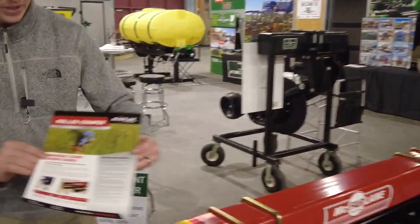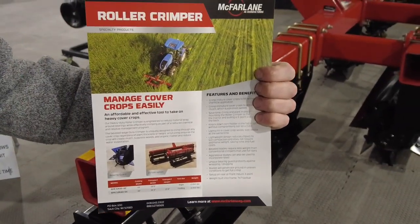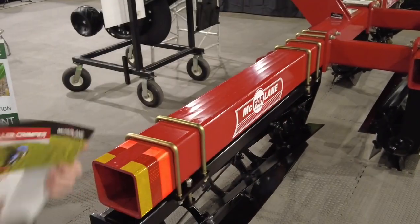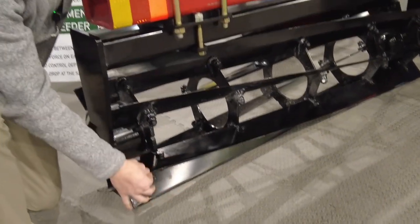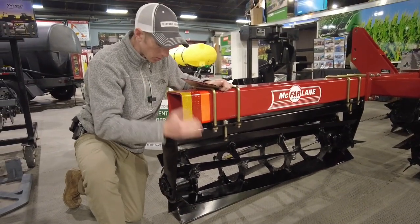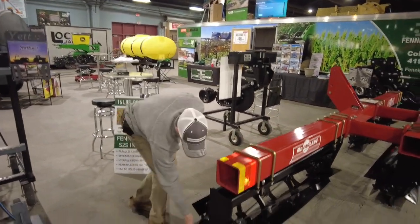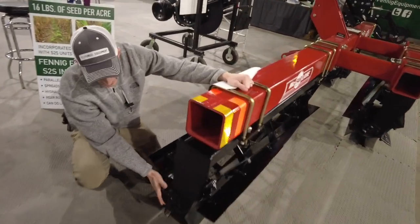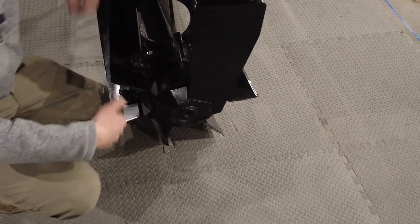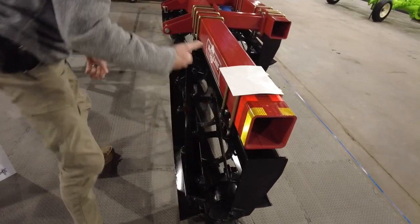You can see on this picture, this can be a front-mounted design, or of course you can put it on the rear of a tractor as well. They're going into stuff that's somewhere around two feet tall, but these crimps on these rollers, it's a real sharp edge — it comes to a point, so you're going to get a really good aggressive crimp. It's a really heavy unit, seven by seven, pretty simple, extremely heavy-duty bearings. They've got anti-wrap shields on here that keep the cover crop from getting into this roller and winding up on the bearing. It's a shaftless roller, again to prevent wrapping up of the cover crop.